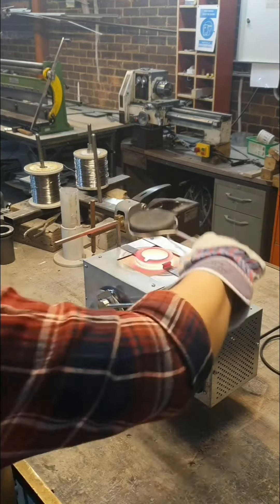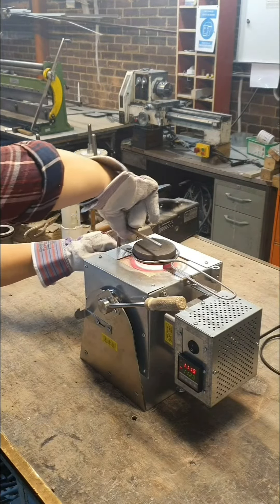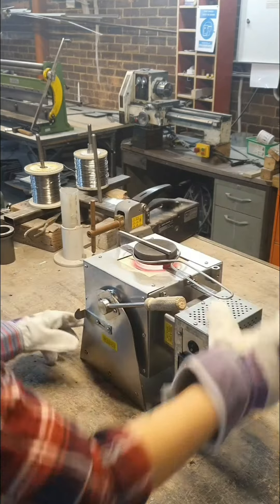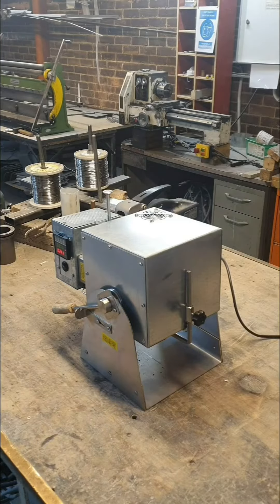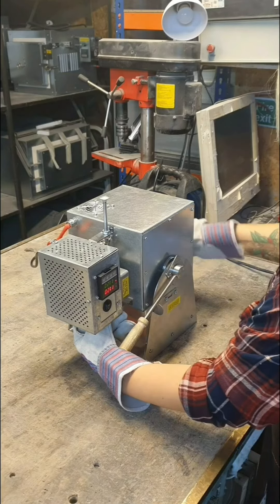When we place a graphite mold on the crucible, please keep it for a couple of minutes to equalize the temperature so that a heat shock doesn't happen. Then turn the kiln, wait for a couple of seconds, and release the mold holder to take out the mold.